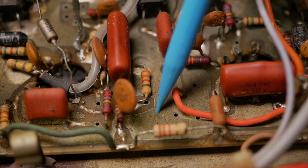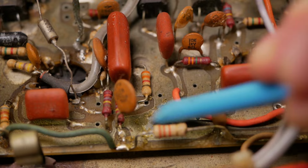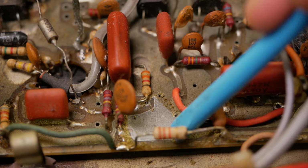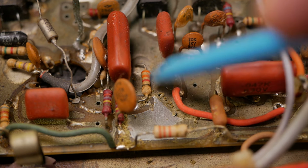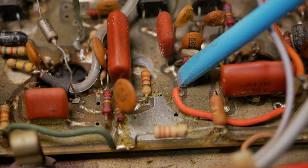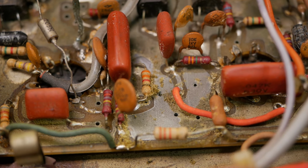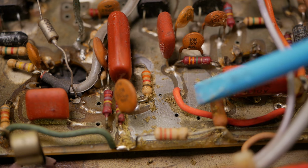And the whole board's covered with this grime. I don't know what it is. It feels almost like it used to be a conformal coat because it's crusty. But now it's got stuff all stuck to it. Maybe a fire occurred in here or something. It's hard to tell. I think it might be someone sprayed a conformal coat on it at some point, but the solder connections are clear. Maybe it was from the factory. The solder connections have it as well. Could be a combination of what used to be a conformal coat. But to remove all that, you pretty much have to depopulate the board and fully rebuild the thing, so I think we'll have to brush off the excess, maybe try some alcohol on it, but that's about all we can do given the time frame and the budget.